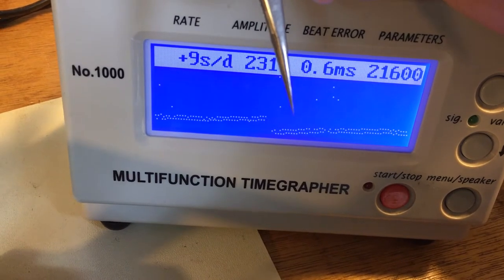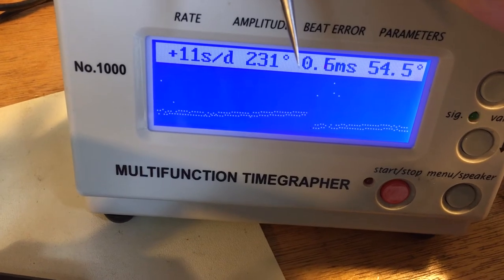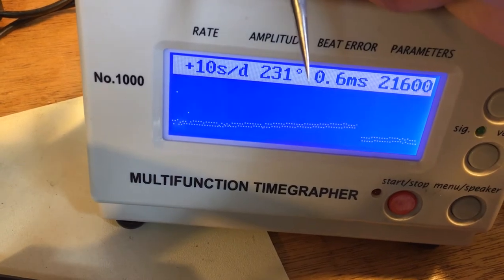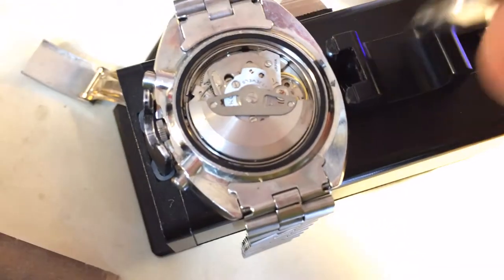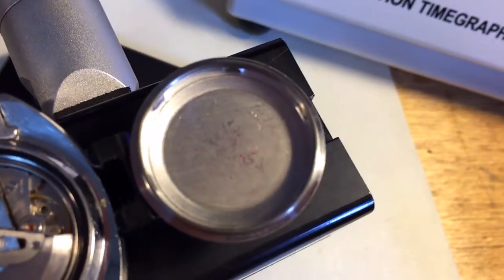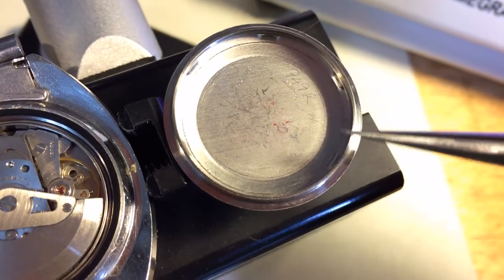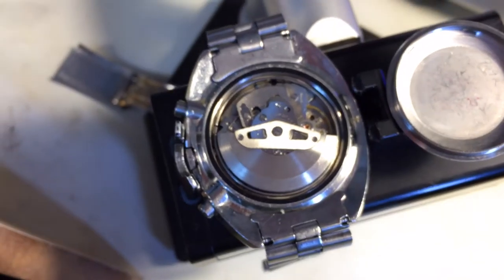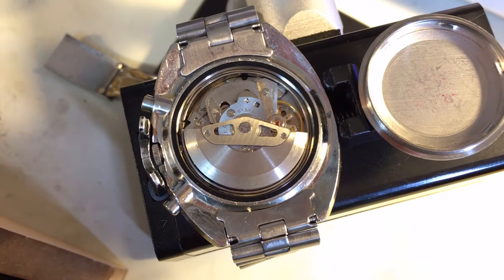Otherwise the movement mechanically is not bad — it's out of adjustment, a little sloppy, but the numbers indicate it's physically in pretty decent condition. They're lower numbers than I'd expect but it's not bad. The watch has gotten a lot of service. You can see it has a ton of servicing marks in the case back — all these little squiggles. They don't really mean anything to me, but somebody loved this watch and it got a lot of work. It definitely needs service and that repair in the lower arbor port.